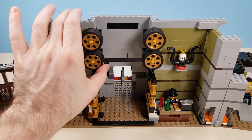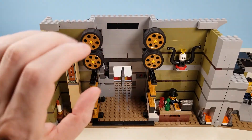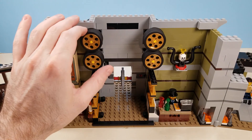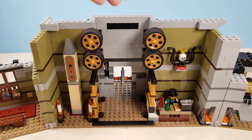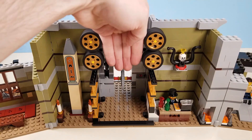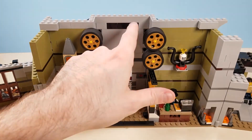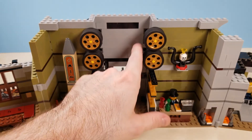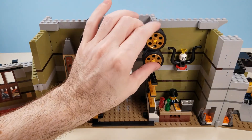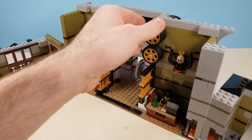The main system that slows it down is the flywheel system. You want to take the energy out of the falling car and transfer it somewhere else. In this case, rubberized wheels on the edge graze the car. On their own those wheels would let the car come through at a pretty fast clip — they could just spin fast without providing much resistance — so they transfer the rotational energy to the flywheel assembly hiding in the back.